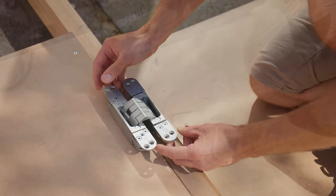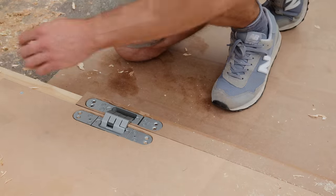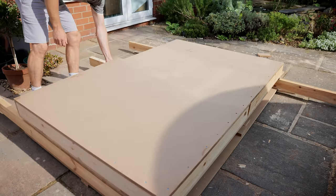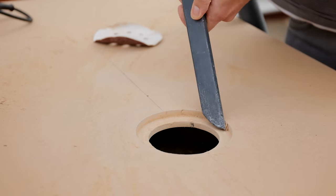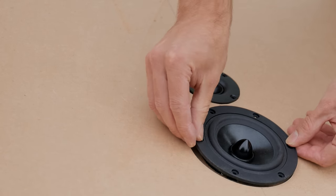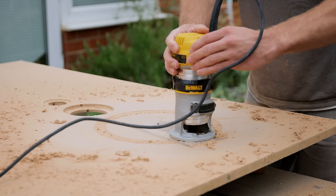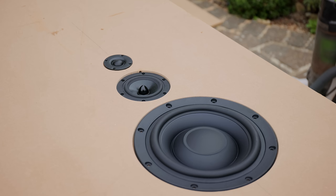The cutouts for the hinges were actually made much earlier in the build while the main unit was still outside, as it's much easier to do with it on the floor. Making sure this is done correctly at such an early stage also allows it to be easily modified to make sure it opens and closes nicely. Before gluing them together, it's important to again add the holes for the drivers. The first hole is for the same model of mid-range driver used for the centre channel to keep the sound consistent. But this time, instead of an AMT tweeter, we'll be going with a more traditional soft dome tweeter, which still sounds great but is much less costly. The last hole is particularly large because we're going to build a subwoofer into each of these side speakers for a really impactful cinematic experience, and we'll be doing some clever mixing later to make the most out of these.